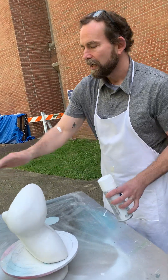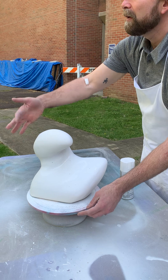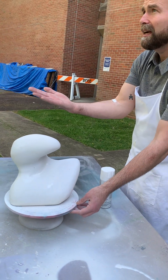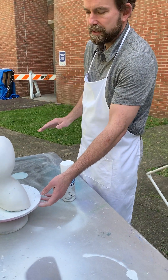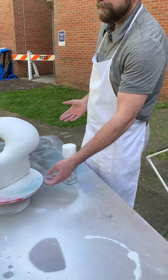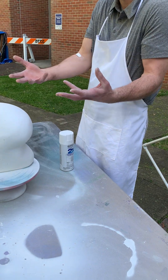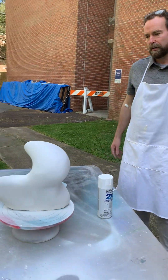If you're just lightly sanding, unless there are areas with a little bump like right here — you might have to sand that out, and you can probably do it with a 400 grit. If not, use the 220 to work it down, then go back to 400 to smooth it out. You paint it three times or so because the paint actually acts as a filler too — not for big holes, but for the small, subtle parts.